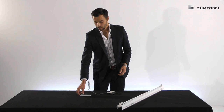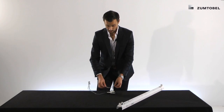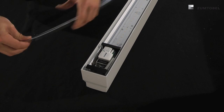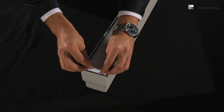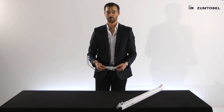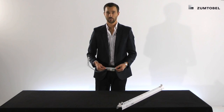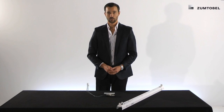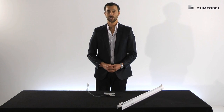To use only presence detection, you just use the mask plate, cover the daylight sensor, and then install it as shown before. Because the daylight sensor is driven by infrared, infrared doesn't go through the mask plate and therefore you only have presence detection based on radar technology. The detection radius of this tool is about eight meters at a typical mounting height of two and a half meters.